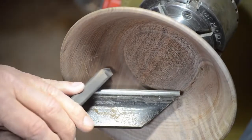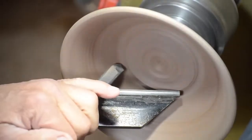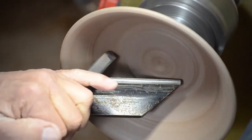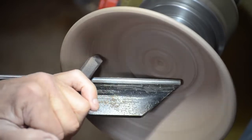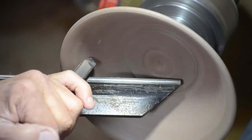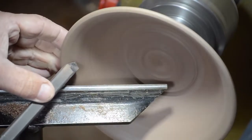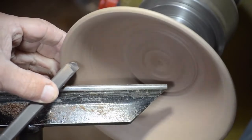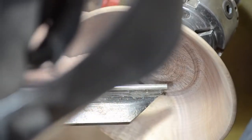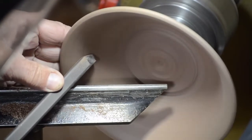So I'll show you that. Right here I'm kind of parallel to the side, so I'm cutting with the bottom of the cutter. If I pull the handle out, I'm shear scraping. I've got the tool rest way too low, sorry about that — go back up. So what I'm going to do is pull the handle out a little bit and just shear scrape. What I'm trying to do is just clean up those little tool marks, or if I had an area that wasn't blended properly. I've got to move the tool rest out just a tiny bit to do this area out here. And I'm going to dampen the vibrations with my fingers. That should leave me a surface — I've got some little marks right there. Normally that would be about 220 grit, but those areas right through there I didn't get quite right.